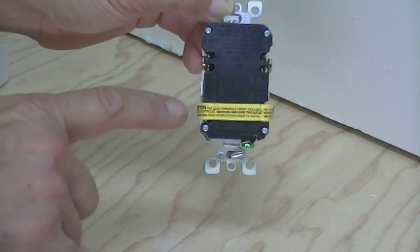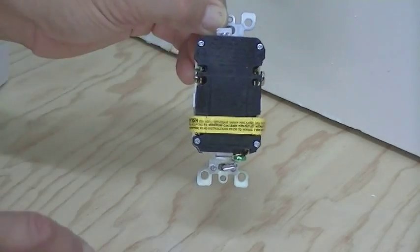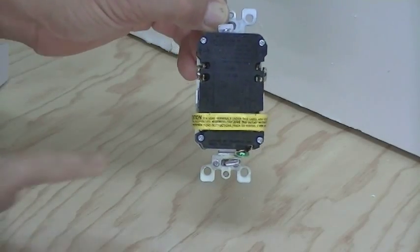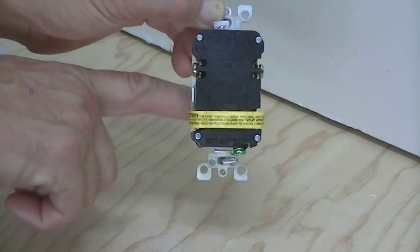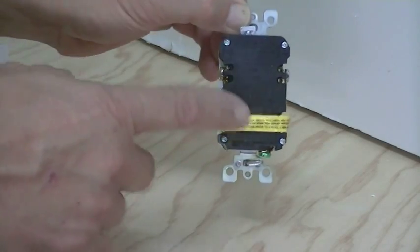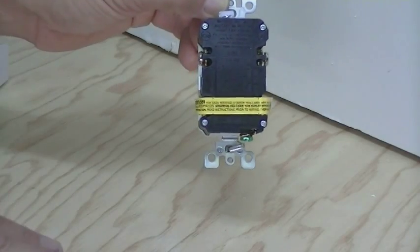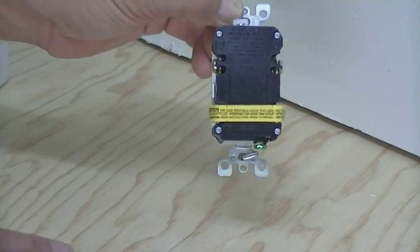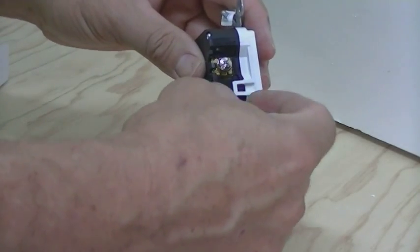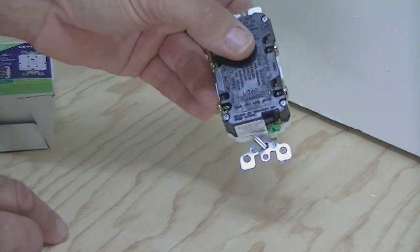Power coming out to go to another outlet is connected to the bottom — but you only connect that to the bottom if you want that power going to another outlet to be protected by this circuit. You can actually have the lines coming in and going out both connected to the top. That means only the power to this one outlet is protected by this circuit, and the line going out is not protected. That's why when we took the other one off we paid attention to how the wires were hooked up — so we can reconnect it the same way and make sure the other outlet is protected too. Let's take this tape off and expose that hookup.